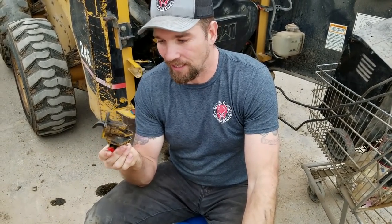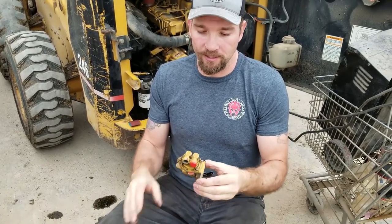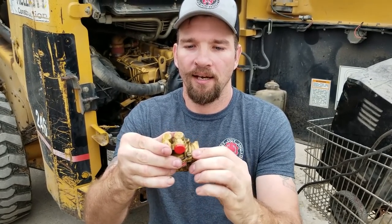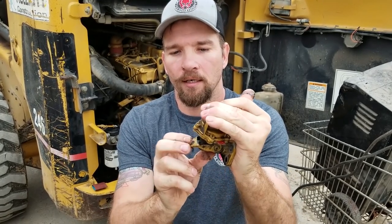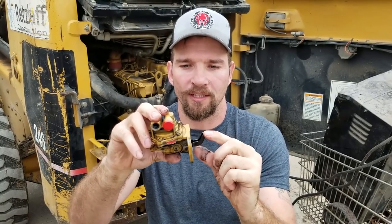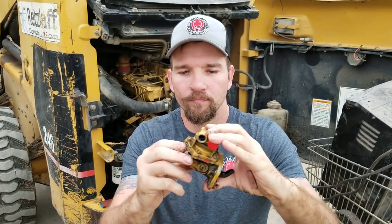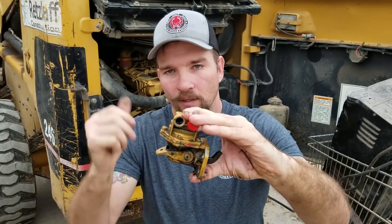A lot of guys will replace lift pumps — they're pretty cheap and they go out a lot. I like to replace these with electric lift pumps, but we didn't have one available right now. A lot of people will grab this little lever and when it doesn't work they'll say the fuel pump's bad. The problem is the cam has a little eccentric lobe that pushes this primer up. If this is pushed all the way up, you can see it doesn't take hardly any pressure at all and they think the fuel pump's bad. No — what's happening is this part is just sitting on the eccentric on the camshaft. You need to bump the engine over a little bit and then you can actually use the lever. I'm not saying every single time, because a lot of times the action inside where it grabs the lever gets worn out and then it is a real problem. But if you grab it and it's that loose, bump the engine over and then try to reprime it.